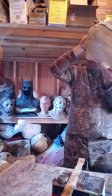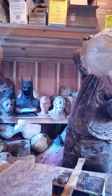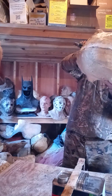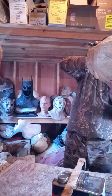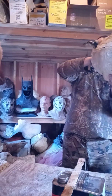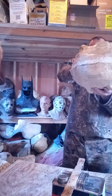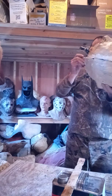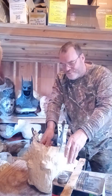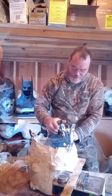Now this just creates a very thin layer. It's not meant to be a thick, viscous layer. It's just to help set up the form and the shape. You can use a little bit more than 3 ounces, but I don't recommend doing a huge batch, because what will happen is the resin will puddle in the middle of the mold on the form wherever it sits. It will puddle down to that, and it will become thick and viscous in that area. So it's not recommended to do any more than, say, 3-4 ounces at a time. There may be people that do more than that, but I'm not going to recommend it. Simply because, like I said, this is supposed to be a thin outer layer.